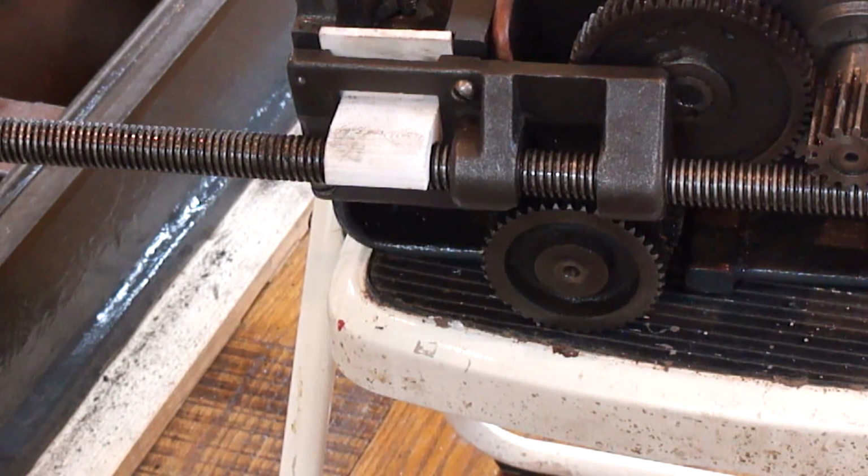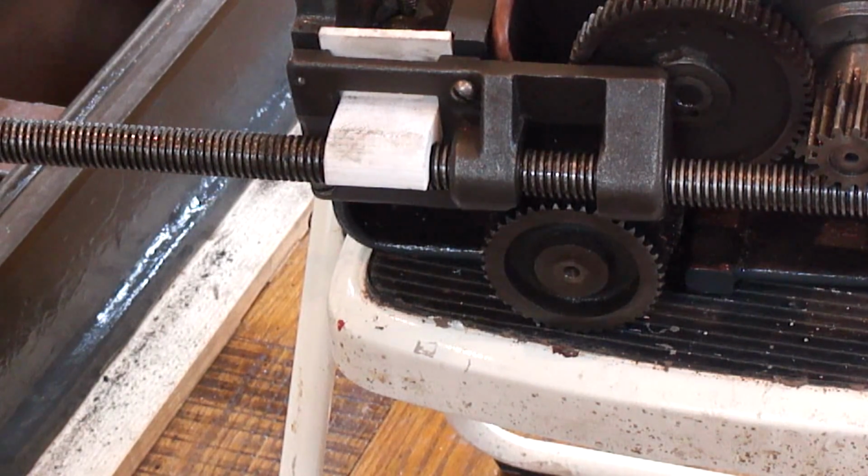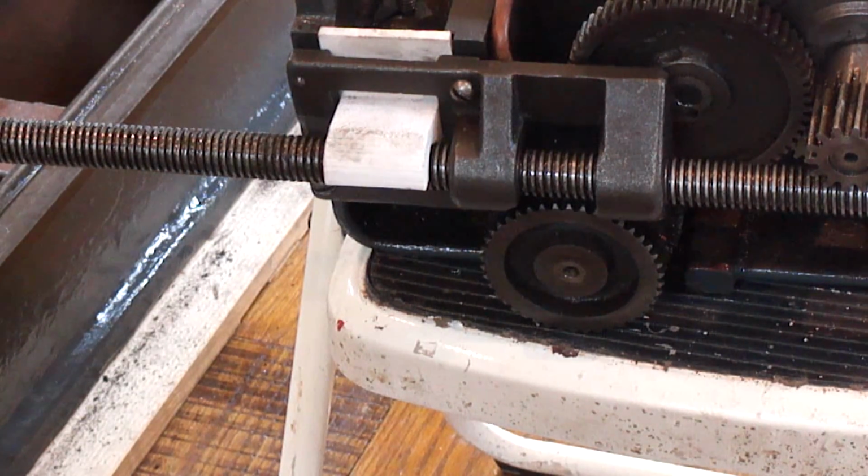It does engage. So, half nut part is halfway there. I've just got to cast that out in maybe zinc. I may do Zamak. It's a good material for half nuts and stuff. Or I might do it in brass. I'm not 100% sure yet. I may try it in both, just to see which one works best and which one pours and turns out.